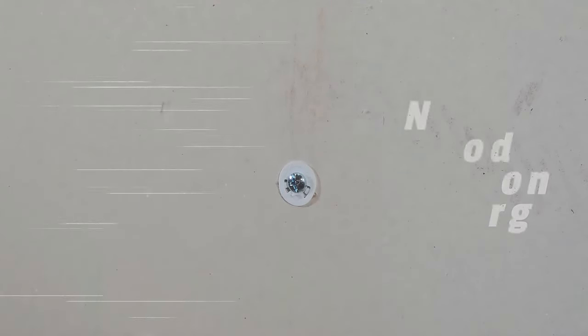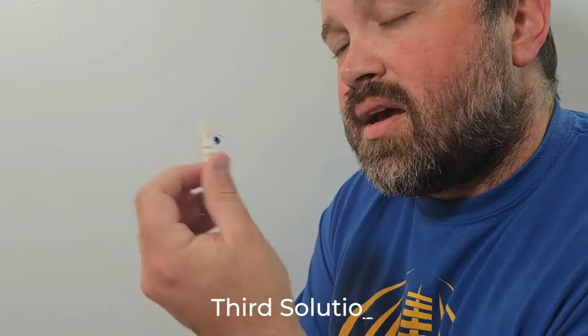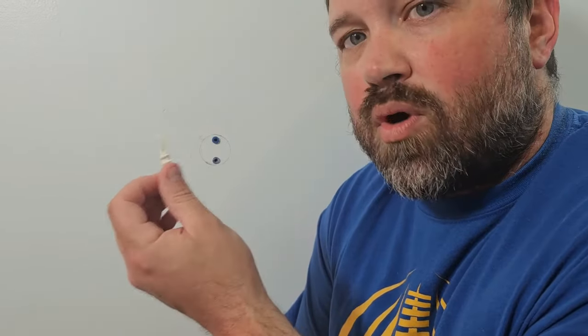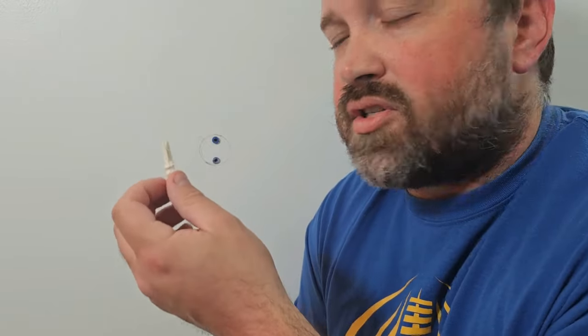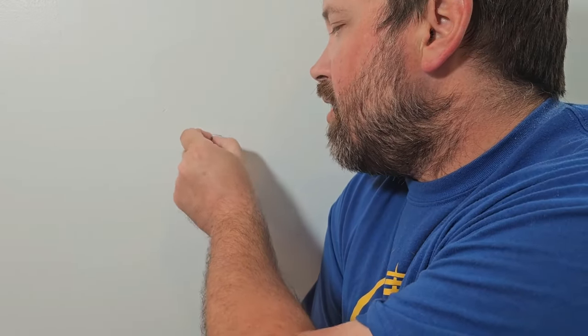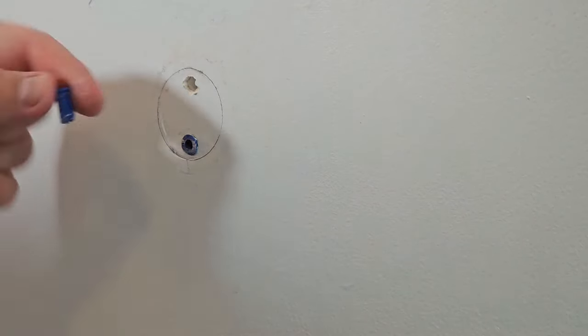Another quick and easy solution for a small hole is your easy anchor. These do come in larger sizes so if the hole is a little bigger it may still work — I'll link to these in my Amazon store. I'm going to demo how to get the old one out. The threads are no longer working on this one, so normally I'd screw the screw back in and pull it out with my hammer, but since the threads are stripped I'll show you another technique: just take your hammer, push that down, and then pull it out. If needed, you can also take a pair of pliers and try to pull it out.